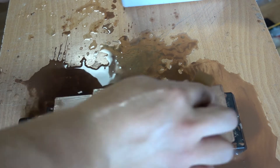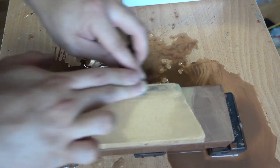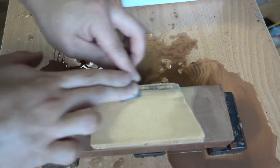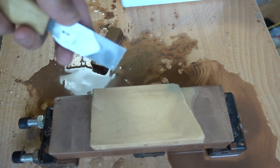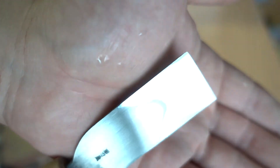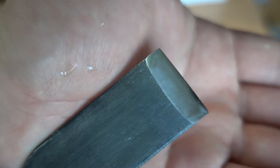I'm getting a pretty good result. It's not easy to sharpen, and stainless steel clogs the stone a lot — chrome clogs a stone very easily. I do this until I see a shiny part all the way throughout the surface. After 6000 you will have a decent mirror edge. For a leather knife, 6000 grit is good enough. You can go higher, but you can also stop at 6000 and then use a strop — after stropping it will be really nicely polished with a razor-sharp edge.